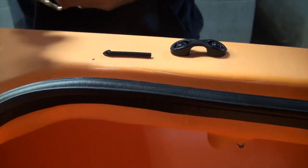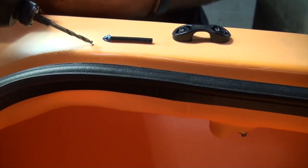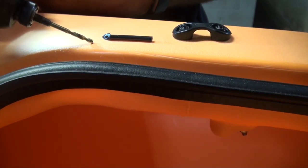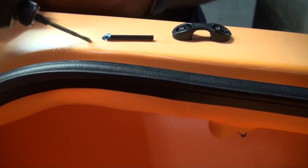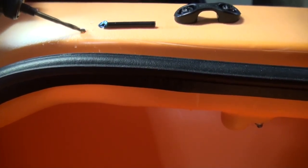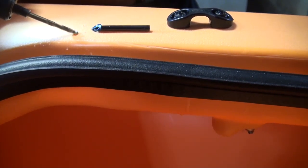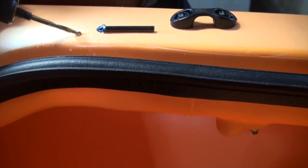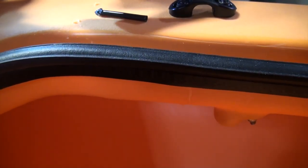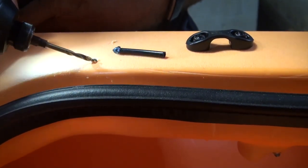So what I'm doing is that I'm coming in, and it's almost like I'm using the drill bit as a mill for the first little bit. It's just kind of scratching, but this is the angle that I want going in. Starting to push forward because I got enough of a groove that it's gonna settle there. So I've only been pushing down with that angle, and now I'm gonna push forward with it and hopefully it starts grabbing. If it doesn't, I'm gonna keep going with the sideways pressure.